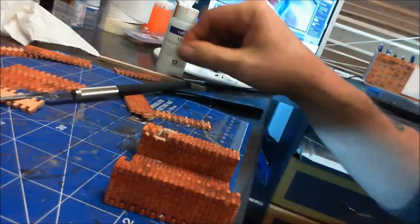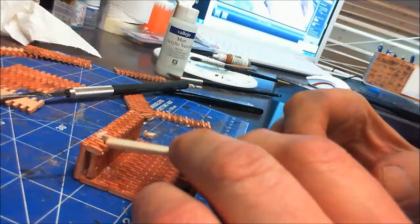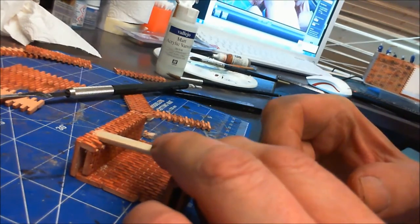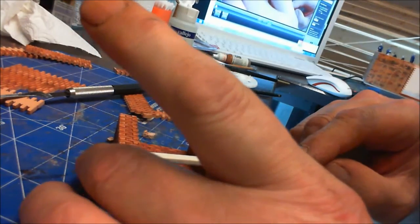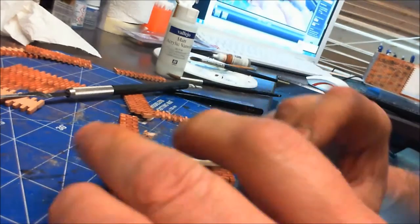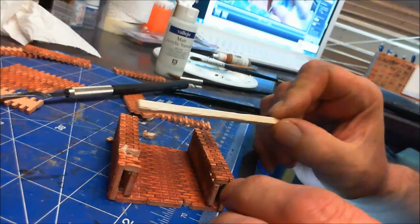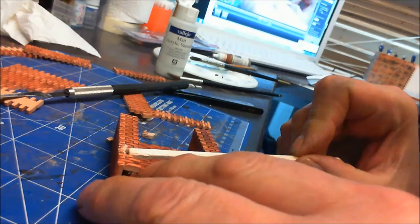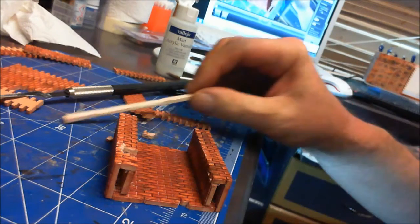Right, I'll prize that bit out of there. So what we've got is a gap. Now I shall just tidy that up, and this piece of timber will sit nicely in there. This is the same width as 2 courses. So what I'm going to do, I'll cut the other one, and I'll get this lintel put in. I've already started just giving it a bit of grain, and then we'll just fix it into there so the brickwork just sits on the top.